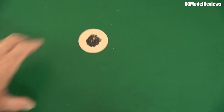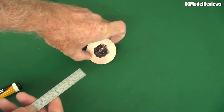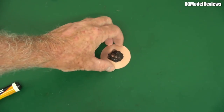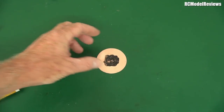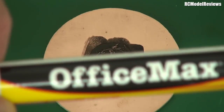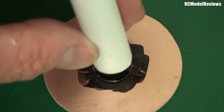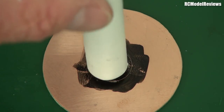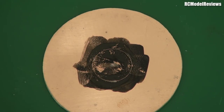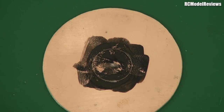The reflector I've decided to use is 52 millimeters in diameter. I've put some marker pen on the copper and drawn a circle the same size as the pipe so I can get it dead centered - centering is important or you won't get good results. I'll wipe the marker off before gluing because otherwise the glue won't stick well to the copper.